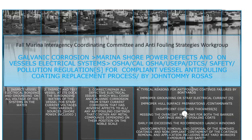The other thing they don't do is there's not sufficient coating thickness. They don't measure it with a mil gauge mechanically, and they should. And they're not requiring certified applicators like I was for every coating. So there's no telling who's put these paints on. Sometimes they have these seminars, but the salesmen don't really know either. So it's a problem.